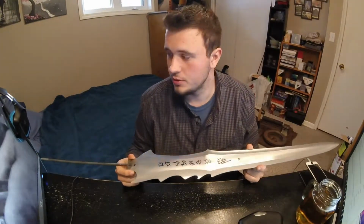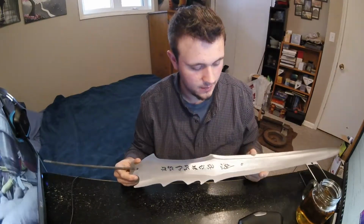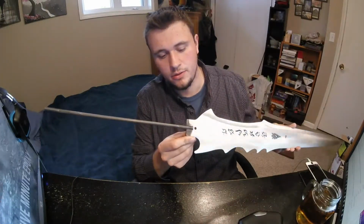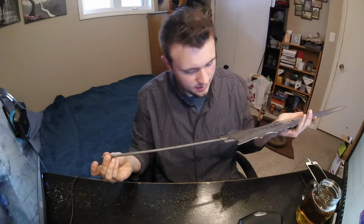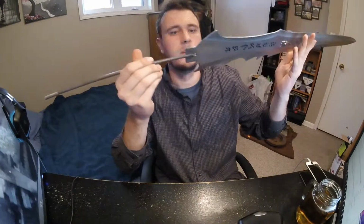Something to look for if you're going to be forging swords or knives or whatever: there's a few different parts of swords that, if you buy them in the store, are not as high quality as you might think. For example, this is a blade from the sword Frostmourne, which is a World of Warcraft sword. When you first buy it, all of this is covered up, and it's like, oh, this is such a cool sword, such a big sword, and people want to go out and swing it. Now with these, and katanas that you can buy in a store, and all different kinds of knives and swords, this is what you call a rat tail tang. They have made the blade, and instead of bringing the handle out of steel, they have tack welded a little iron rod onto it. So the only thing holding it together is this little weld. It is only on one side, and it's not straight, and it's not the best weld in the world.